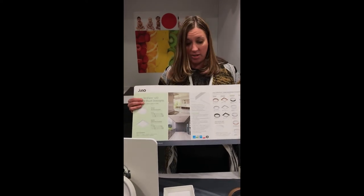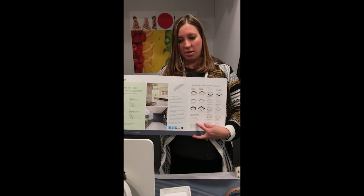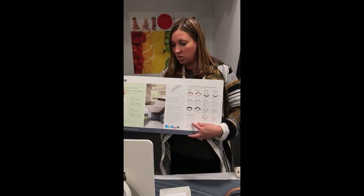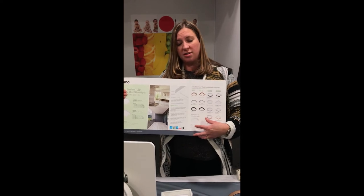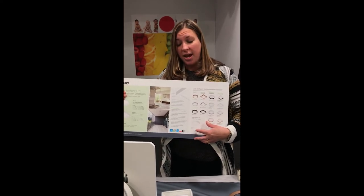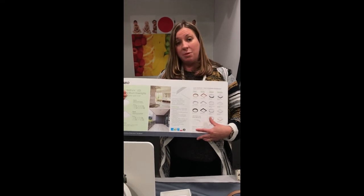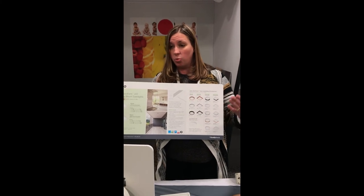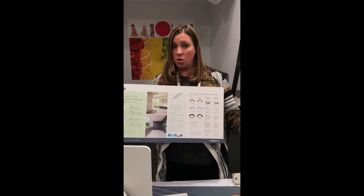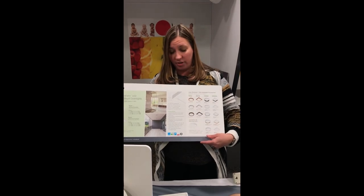Something that we also don't have as part of this case but needs to be talked about is the emergency option — an emergency battery backup option that's integral to the fixture. It's a separate back box for fixture sizes 11 inch and above, and the battery and test switch are shipped with the product. We also have an empty back box option. For example, if you're doing a corridor with a row of fixtures but only need emergency in one, you can have that same look across the whole row.